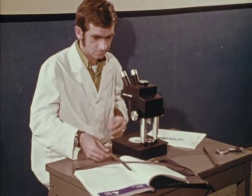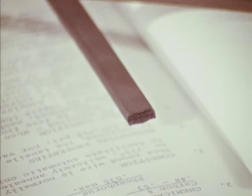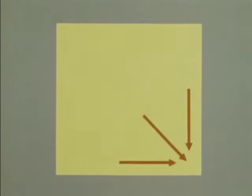Also of great importance is the shape of the wire from which the helical die spring will be wound. Common from earliest times is the round spring wire cross-section. Although the stress flow in round wire can be controlled, the amount of material for the wire's size is not sufficient for optimum load carrying. Putting more material into the space with a square results in high-stress concentration in corners and produces a great potential for metal fracture and spring failure.